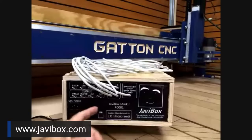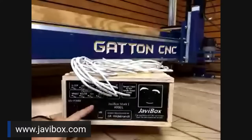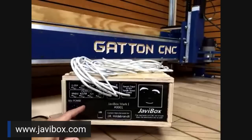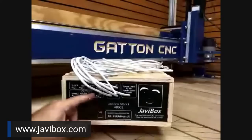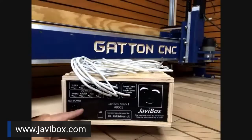There's a scratch here, because you CNC guys are going to love this one. This was made on a very expensive engraver, a high precision engraving machine. But basically, it's nothing more than a CNC made with very expensive and very precise parts. Now, all the parts in the world, no matter how precise, cannot overcome human error. When I told it to cut this hole and these little holes, this is the first hole it cut, and I forgot the clearance. I put the clearance at 0.1 instead of 0.2, and it took a nice little gash through here, which you can't see on camera, but I could feel it, and it's driving me nuts.